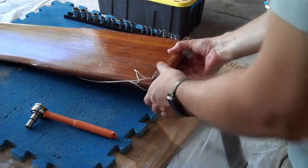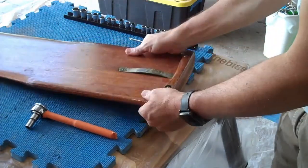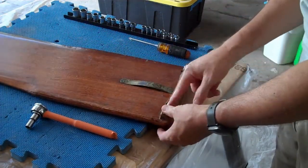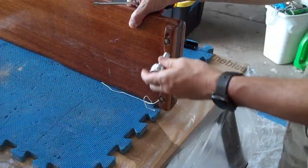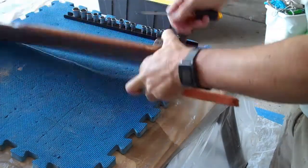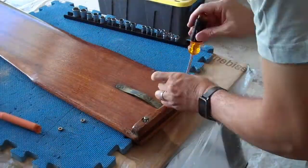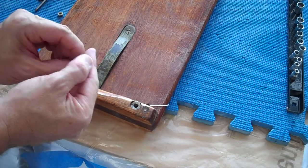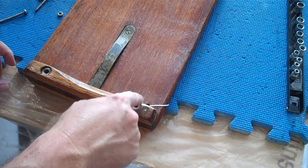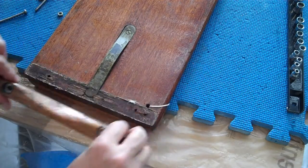The dagger board has four major pieces: two handle pieces of wood, the main piece of wood, and this spring clip. There are Phillips screws, and I found a 3/8 works well on the nuts on the other end. There was varnish inside the screws and a little bit on top of these flat washers, so it looks like somebody varnished the whole thing without taking the hardware off last time.